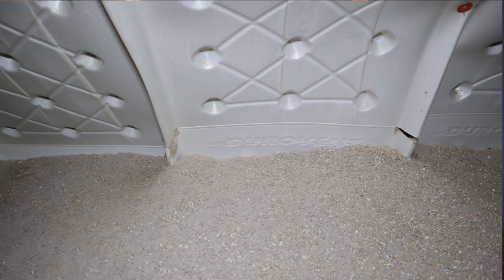One of the things people forget about is they need to actually insulate on top of the walls, not just on top of the ceiling. You want to keep that thermal blanket as consistent as possible going all the way from the outside of the wall on one side of the house to the other side. If your heel height is too small, you're going to have a very small amount of insulation you can put on top of that top plate and you'll lose efficiency. Figure out how much insulation you need in inches, then add about two inches — that should be about your heel height. That extra two inches is for the insulation baffle, which sits about two inches down from the roof deck to allow airflow from your soffit all the way up to your roof vents so your attic space is vented.